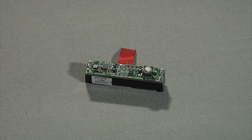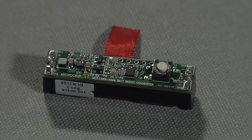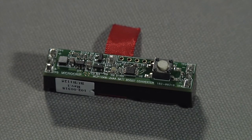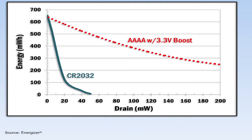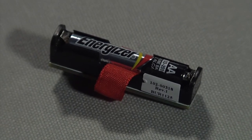Here I have a single cell reference design based upon the Energizer Quad A battery. The total board footprint for this power supply is 3.5 cm², almost exactly the area of a CR2032 coin cell. By implementing a feedback loop between the PIC MCU and the MCP1640, reliable low-power operation is achieved. When compared to a CR2032 coin cell battery, this MCP1640 design has 15 times higher continuous current and between 50% and 1300% higher energy delivery depending on the current requirements.